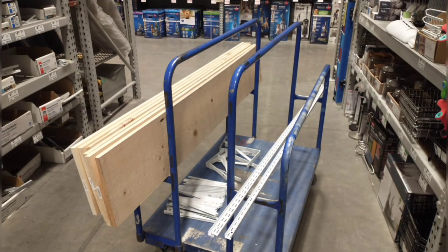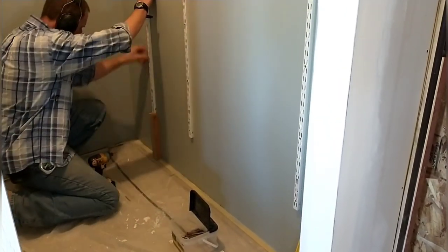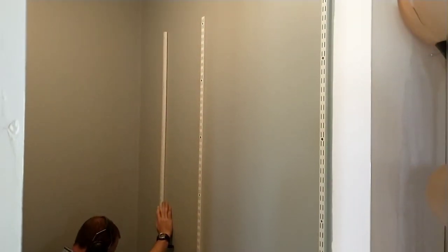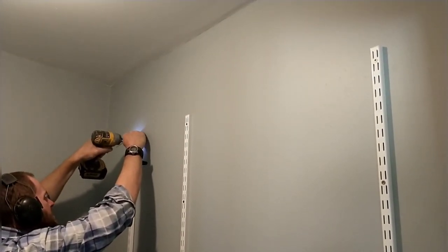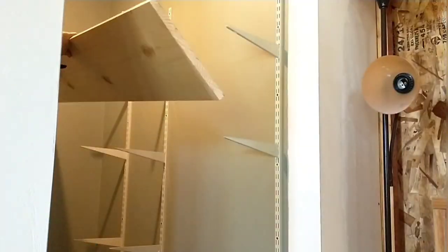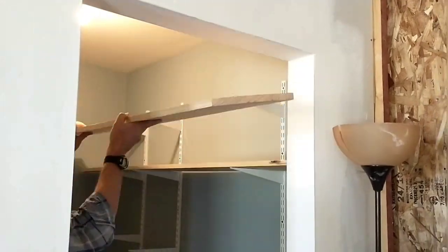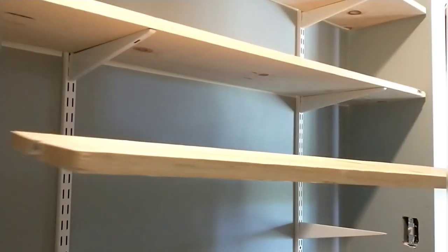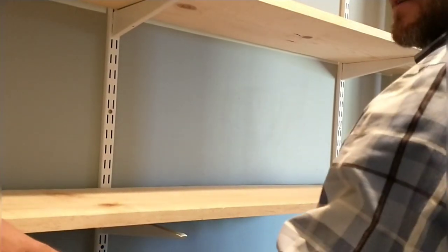I'm installing the light fixture in the pantry and pretty soon we'll have the light done. Then it was off to Lowe's to get some shelving. We decided to go with an adjustable shelving system, filling the whole wall with shelves we can adjust to any height. I put in three rails on studs and I'm making accommodation for five shelves on this wall. These are pretty easy to mount — just line them up with the 2x4 underneath and screw in with heavy-duty screws. For the shelf boards I just went with 1x12s, picked through the lumber for some nice-looking wood. They were already really nice and smooth, right width for these hangers, and I put a few short screws in from underneath to keep them from moving.